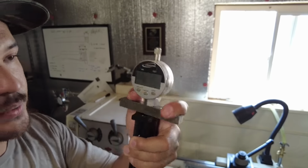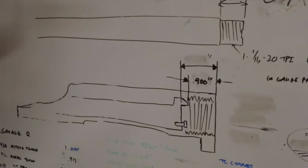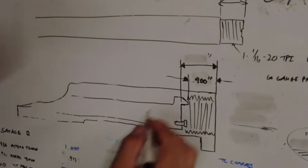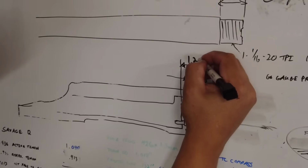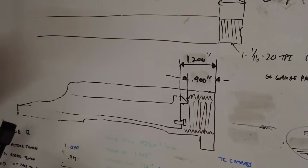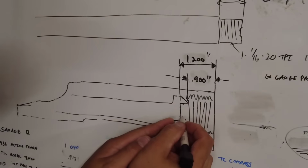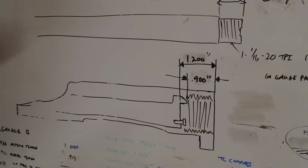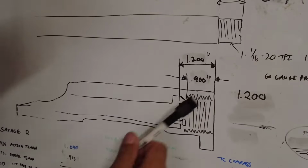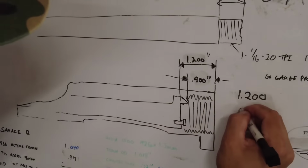1.020, so 1 inch and 20 thousandths, and we'll get that measurement written down here. So 1 inch and 20 thousandths from the bolt face to the front of the recoil lug is what we measure, right? And we found out that the top of the bolt head to the front of the recoil lug is 900 thousandths. Now, to get our go gauge protrusion, which essentially is our head space, we're going to take 1.200. We do know that our tenon length is 5/1000ths less than 900 thousandths, so